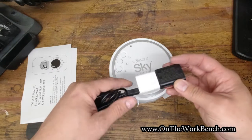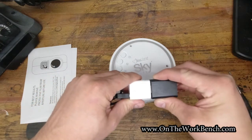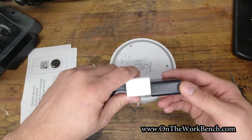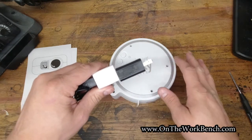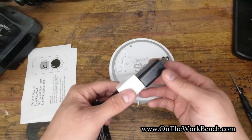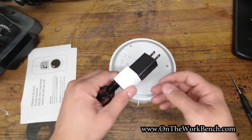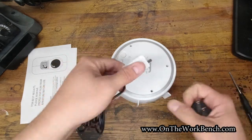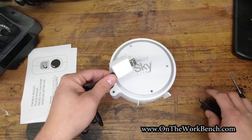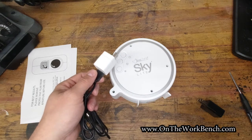You could also put this inline with a USB adapter to extend the length. The adapter that comes with it draws only 0.2 amps, so this is a very low amperage device. It is a little awkward having these two devices piggytailed together, but if you have an outlet with USB built in — like many outlets or power strips you can get now — you can simply plug the Sonar adapter into the power strip, drop the USB block altogether, and you're good to go.